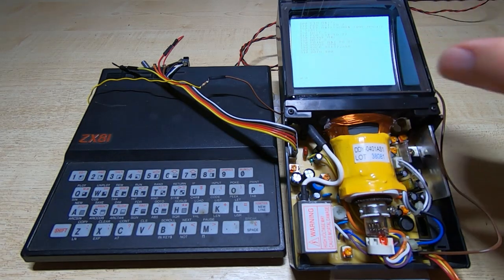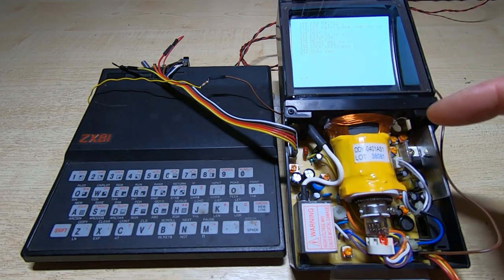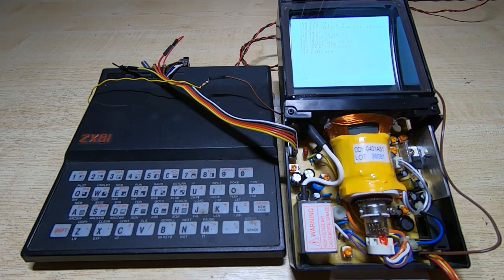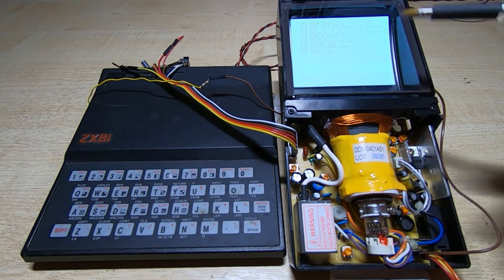There was also a lot of distortion, and that really came down to readjusting the pots and also these deflection correction magnet rings down at the bottom here. There are two of them — they were kind of glued in place. You've got to very carefully remove the glue, being very careful of course as the neck is very fragile. Once I got those off, I could readjust it.